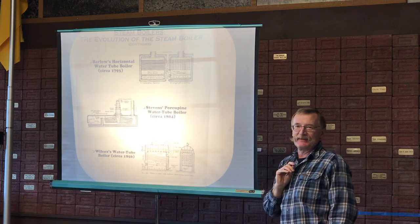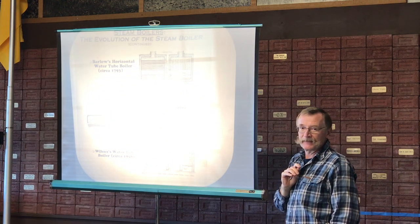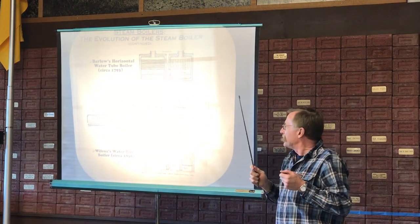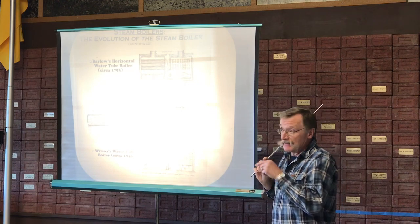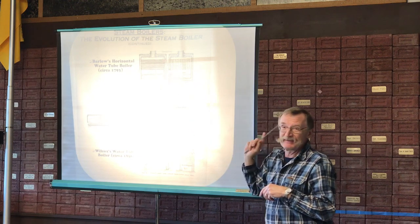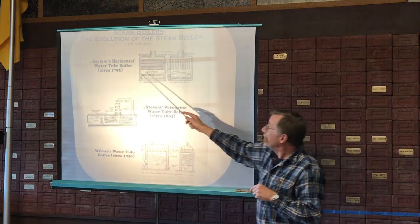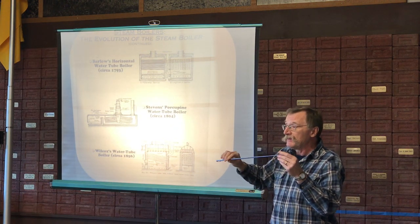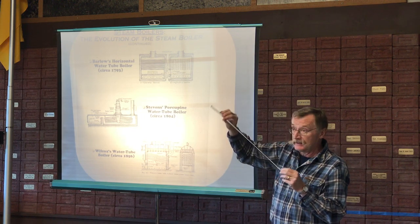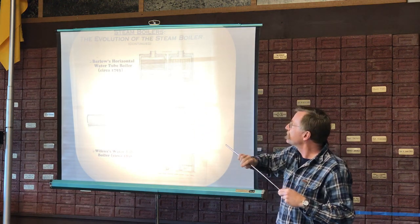That same question comes to my mind as well. If it's housing tubes inside, and if these tubes are all the same length, it's square. In fact, a couple slides up, you'll see that we have a boiler on site here not too different from this boiler — the Westinghouse, probably. So right idea of putting tubes in, but with a little more thought, if you could tip those tubes on an angle, you'd have a much better chance to get natural circulation in the boiler. It's very desirable.